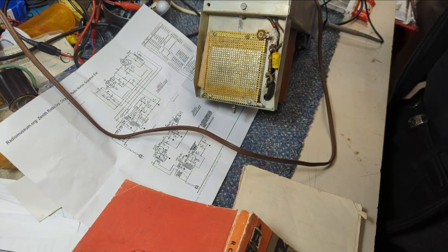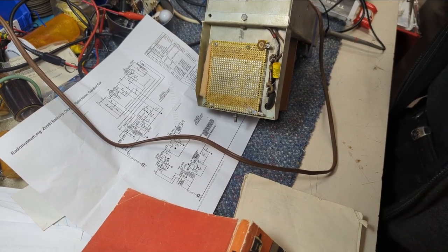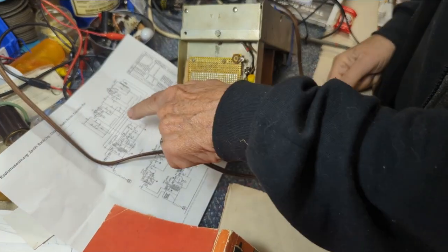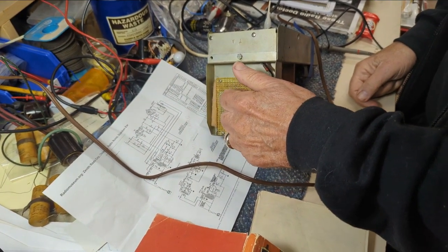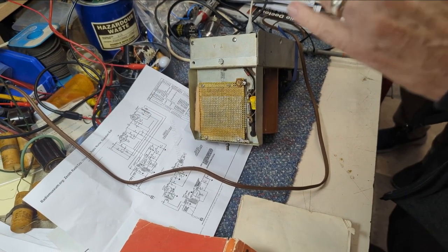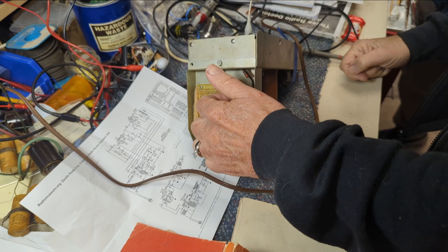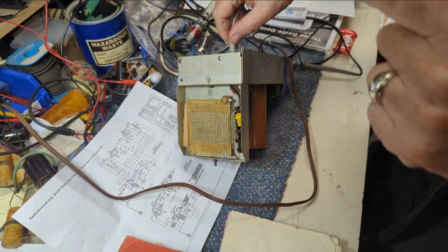Now, we're also biasing it 50% more than it should be biased. The B of the batteries. See, they wanted 1 volt, and we've got 1.5 volts on the negative. So we're probably cutting the tube off, close to cutoff. That's the other reason it's distorting like that. Let me go straight to the grid.